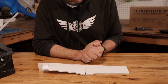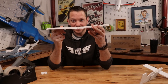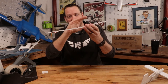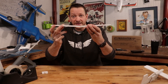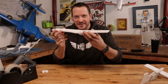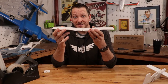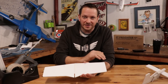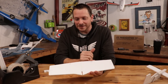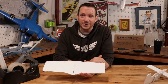Once this has dried for about 45 seconds to a minute, you'll notice the wing doesn't move when you pull it off. We now have the proper dihedral angle — when the plane banks one way or the other, the low wing generates more lift than the high wing, causing the plane to naturally right itself. Too much dihedral makes the plane difficult to turn; too little makes it skid through the air and be unstable. This is the magic amount for this airplane, but when designing your own, you can experiment — less dihedral for more maneuverability, more dihedral for more stability.